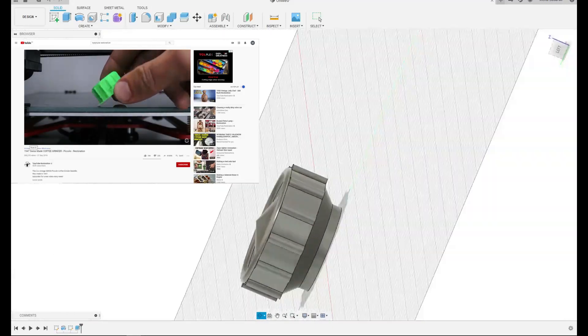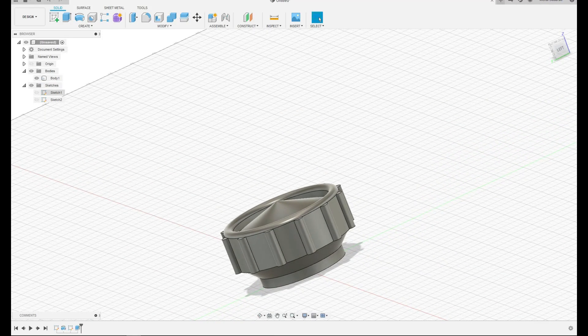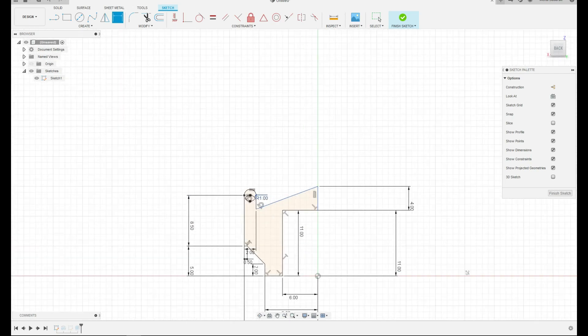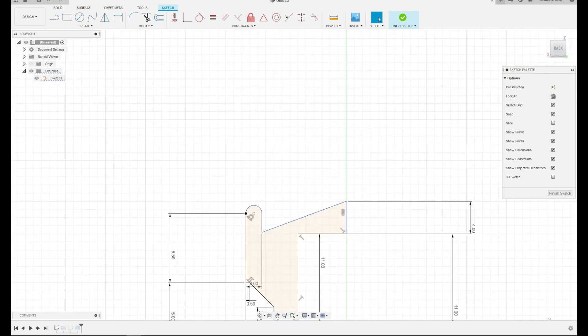We still need to put some small rounded ends on the ribs. I can see we're going to slightly extend that part. We're going to remove this dimension — the dimension was actually from the bottom to there, that was 8.5 millimeters. Much better. We're going to remove this part and stop it here, and then just extend it. There you go. Finish sketch.